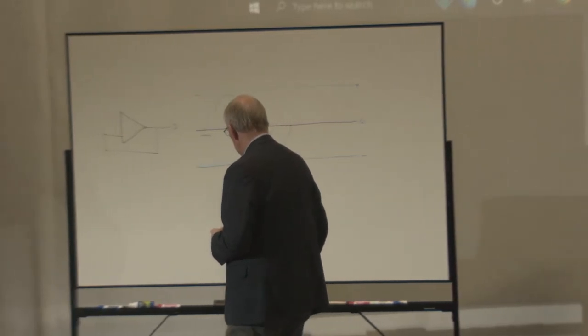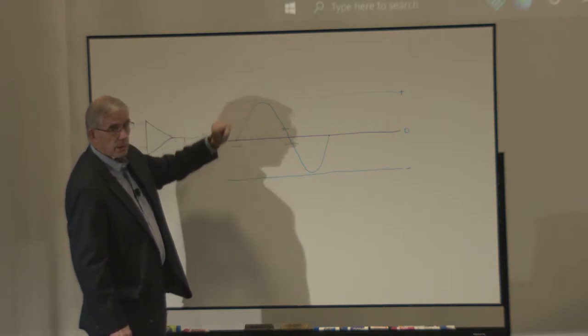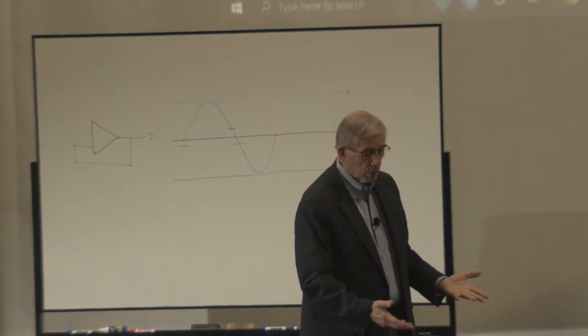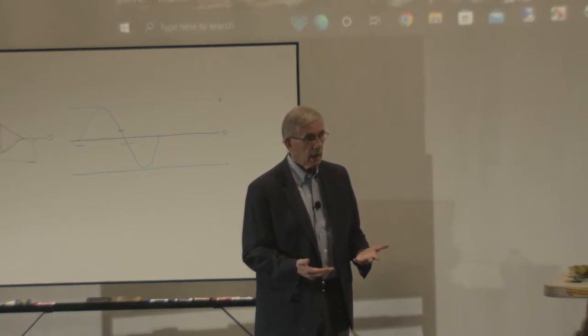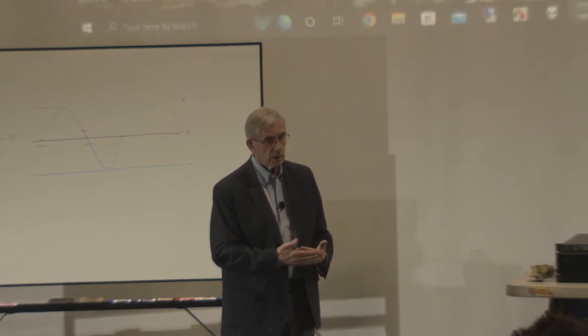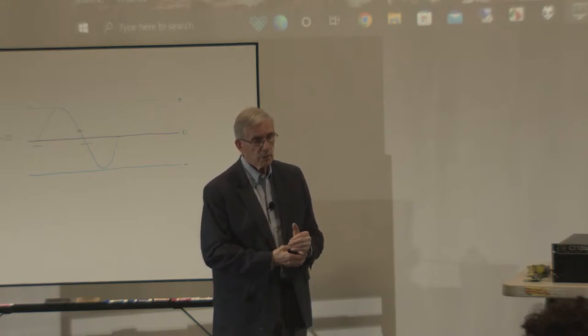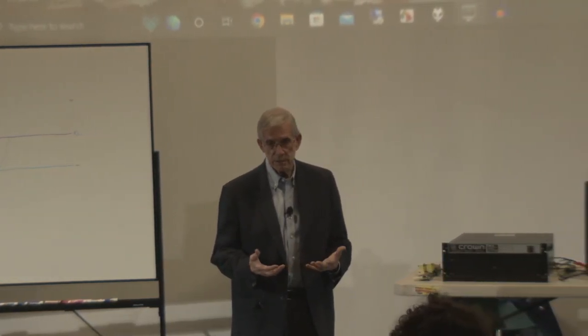Now, we were going to talk about headroom. The amplifier can put out, in the peaks, it can allow your peaks to go fully to the rails, and in some amplifiers, like a 100-watt amplifier, for instance, the rails are 28 volts. And even though you're running RMS, what you hear, the whole level, it allows the peaks to go up to 28 volts. And in music content, there are a lot of peaks.